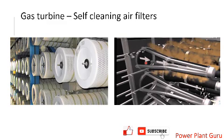This is a clear image showing how the filter is cleaned from inside. These are the pulsation nozzle points where air is blown, and once blown from inside to outside, the dust particles dislodge. To summarize: normal airflow is from outside to inside, and pulsation airflow is from inside to outside — that is what dislodges the dust particles. This is a simple concept but may not be clear to people who haven't seen it physically, which is why this video was made. Thank you for watching.